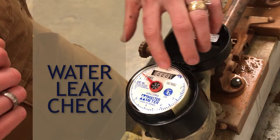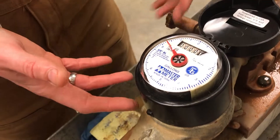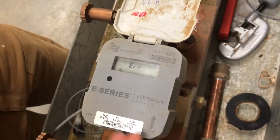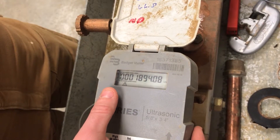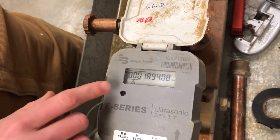We're going to show you today how to do a leak check utilizing some typical meters that you see at your house. First, make sure all the water inside the house is off. Go out to your meter box and take a look at the meter to determine if water is flowing through the pipes. This would be a traditional mechanical style meter — if you don't have any leak, you shouldn't see any movement at all. Some customers may have a solid-state meter, which reads down to hundredths of gallons. It has a flow indicator, so if there's no flow, you'll see an ERR message or a zero.